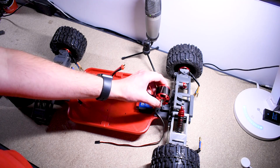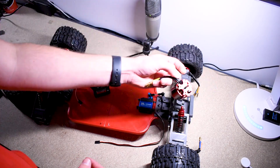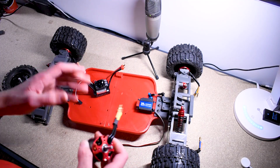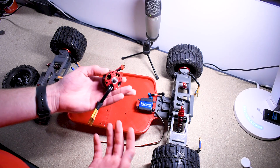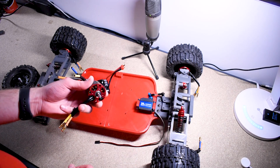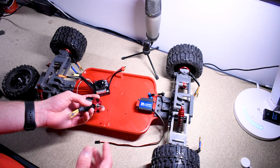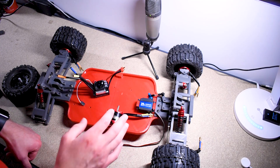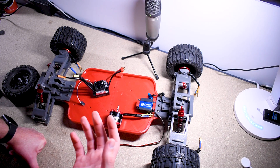I'm thinking maybe a bevel gear or a standard gear system, with the two motors mounted up somewhere on the chassis — whether one's oriented this way and the other that way with gearing between them. I'm not too sure yet but I'll play around with that. Some of the next videos will show me testing a motor in a gearbox situation — I'll mock up roughly a 5-to-1 ratio, see how it performs, attach a wheel, and see if it's worth it. I'm sticking to the all-wheel-drive approach, which I think adds something genuinely different to the RC community.